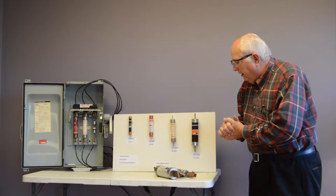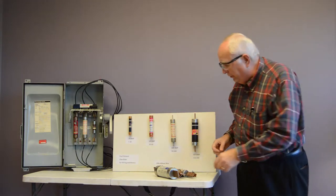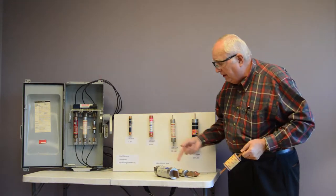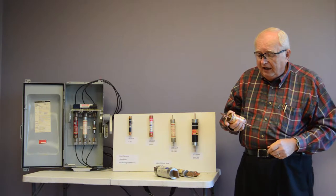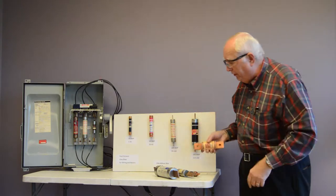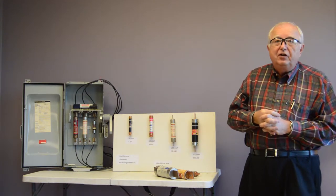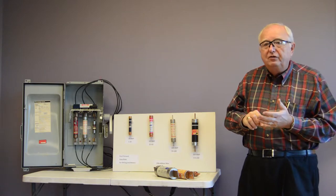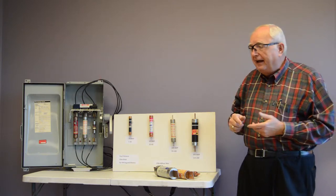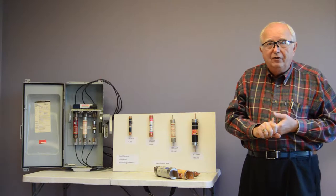Okay. You know, there are literally dozens and dozens of different types of fuses out there. They come in all shapes, sizes, colors. Like this is a limitron. It's a quick-acting current limiting fuse. But today, primarily, we're going to talk about fuses that we use to protect motors and electrical wiring. And that's FRS, FRN type, slow blow,